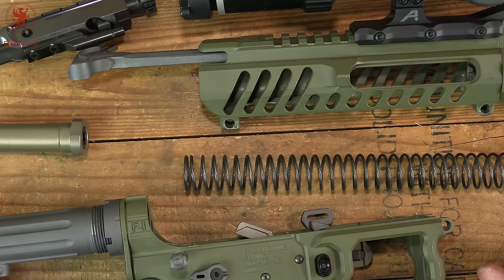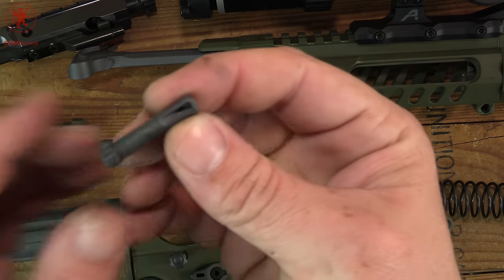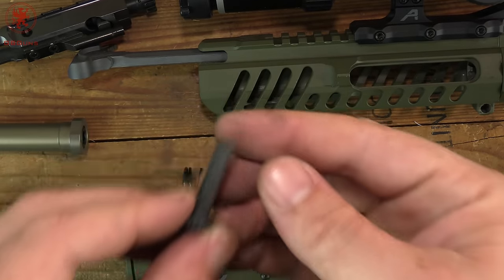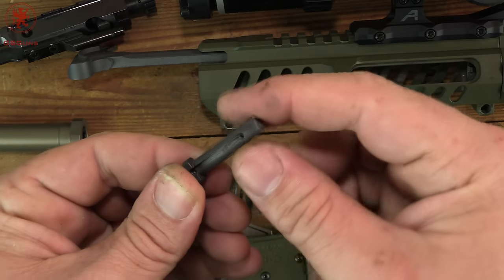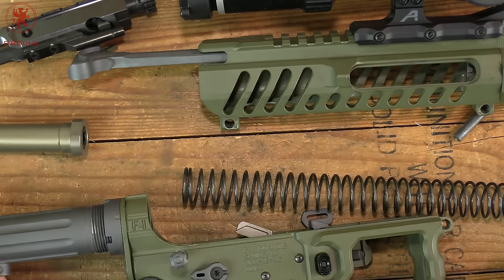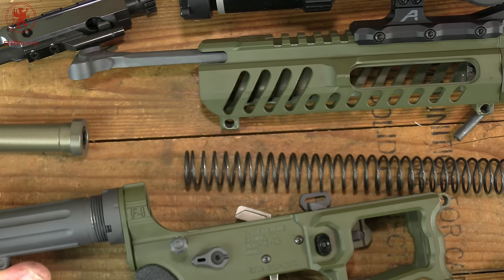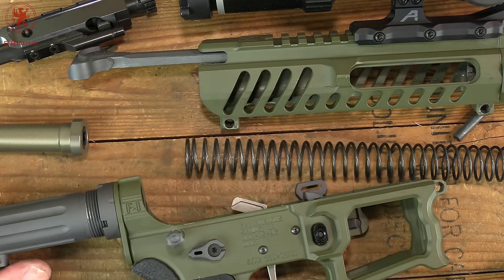What's doing it? I'm at a loss. I would love to hear your thoughts. Frustrated that I just lost the detent showing you these things? The idea behind this pin system is you insert the pin, pull forward, twist, and then it finds its home. But this system does not work well — it's an example of tolerances stacking the wrong way. What happens when nothing is mil-spec is you lose compatibility.